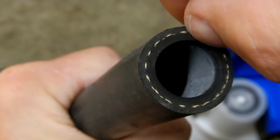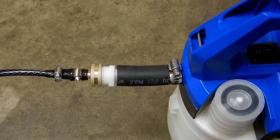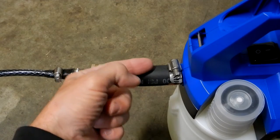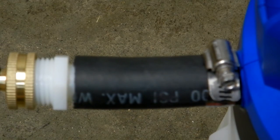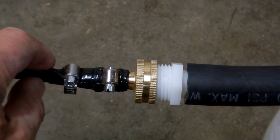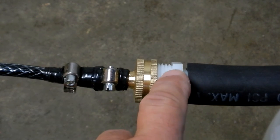That got me thinking. I had Daco 3/4-inch ID, 200 PSI burst-strength hose from another project. I cut a piece to the right length to serve as the interface between the Cobalt outlet and whatever I'd use on the other end. I used a utility knife to cut a chamfer on the inside edge all the way around as a lead-in, making it easier to push onto the threads. Then I rotated it clockwise until it literally threaded on right back to the housing.